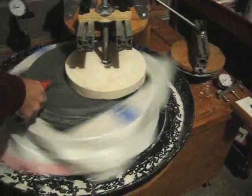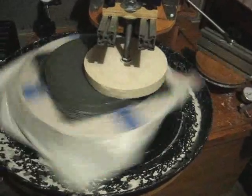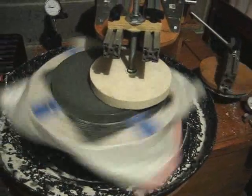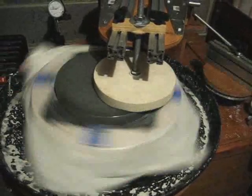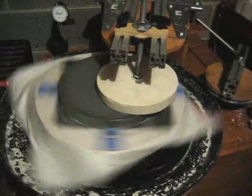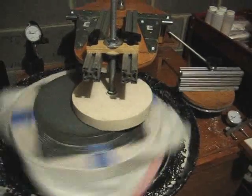I'm going to add some more grit to it — now a little bit of water. You can hear it change its pitch as I add water. And that's it. Instead of me walking around the barrel getting sweaty, I can just watch this thing go. I've got it at 85 RPM right now and that's pretty fast. I might move it down to 60 RPM so it's not as messy.